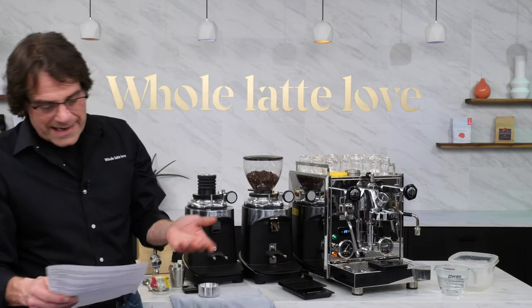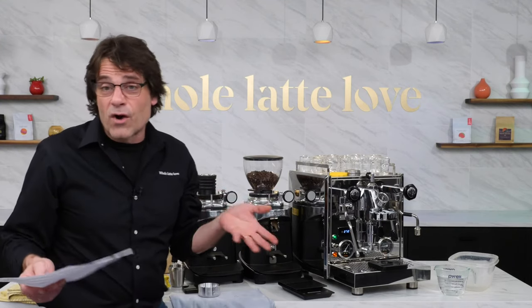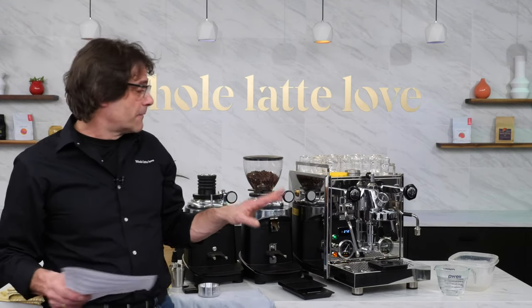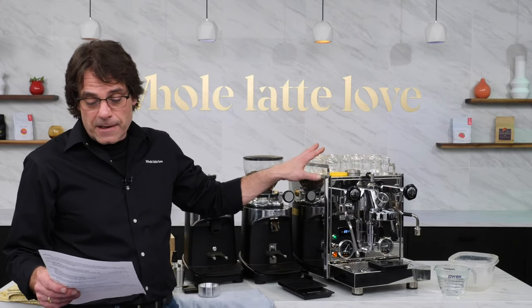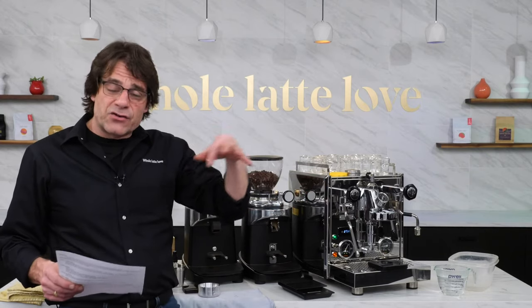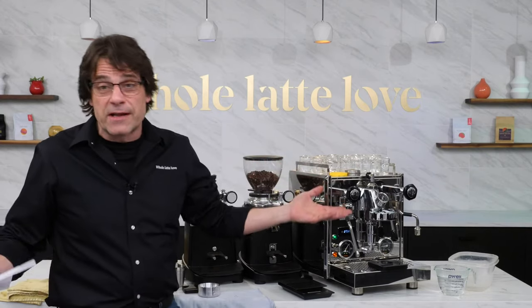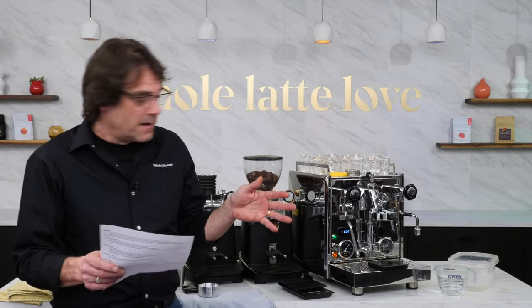So we ran through the calibration. Let me just make sure there's anything else we should be talking about here. So never run it wide open. If you have a Pro 700, you're probably at about 1 1/4 turns. If you're going to do that calibration again, measure how much you get in 20 seconds. You can do 30 if you want, and then just divide by 30. I found that pretty accurate at 20.